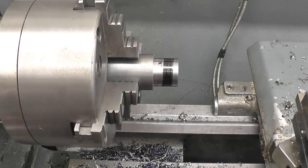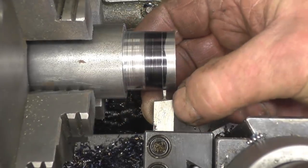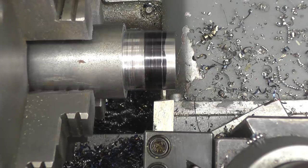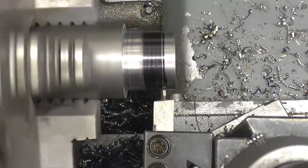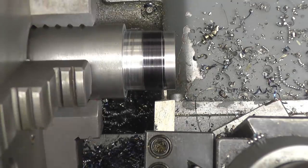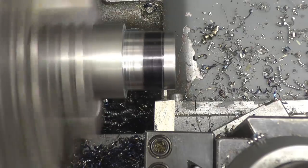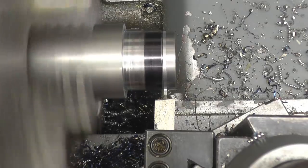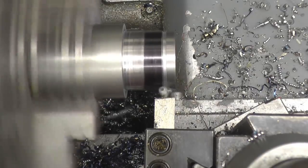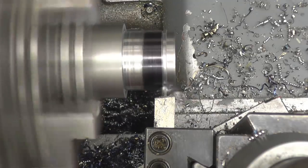There's an easy way of doing something — just do it. I've got a large selection of small high-speed steel tools that I've been given or found at motor car boot sales; they've all got different grinds on them. That's like a little parting tool — it'll be ideal to put this circlip groove in at just the right width. I just need to go on the outside of that marking, with a little bit of room. Very gently, just dial more into depth. It's about as deep as the original, so that should be fine.